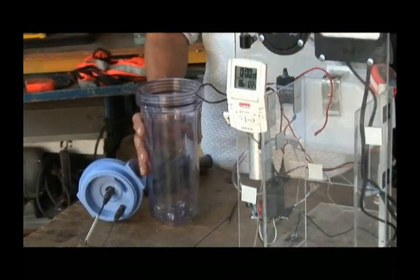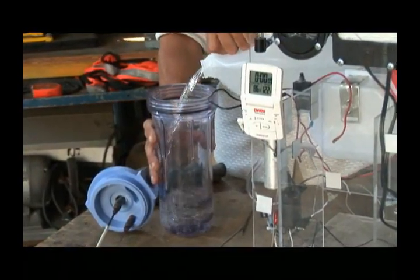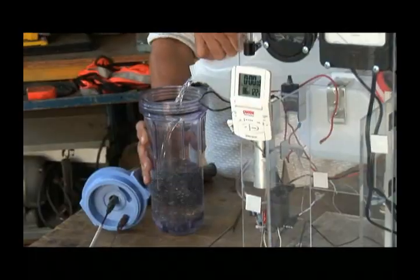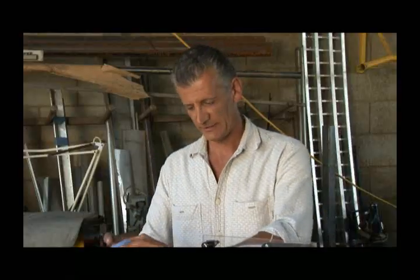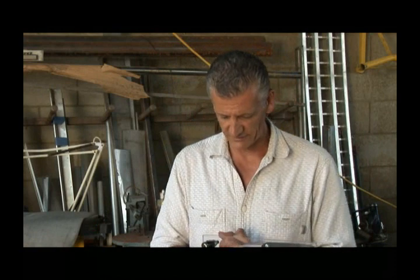Now, we're going to put some water in our little tank. You guessed it — it's going to be distilled water, not tap water, not spring water. It has to be distilled. We don't want to fill it up all the way; just halfway would be fine. Now, we're going to put our anode and cathode array back inside. We still have to put in our electrolyte, which is KOH. But first, I'm going to talk about the process a little more.